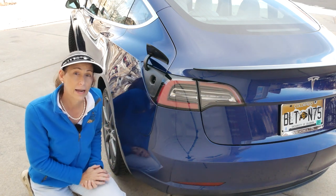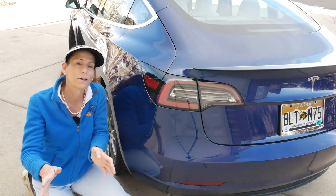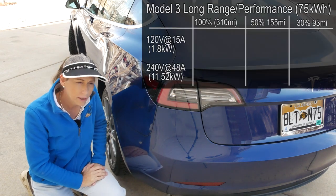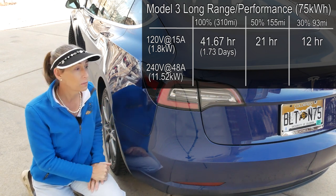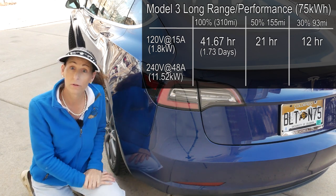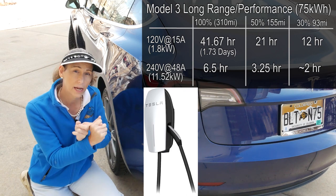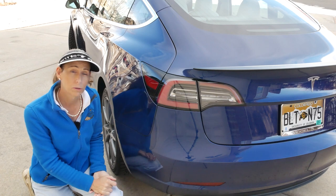To get a really full charge, you're probably going to have to do that at home. It's a paradigm shift — we're so used to filling up out and about, now we fill up at home. You can't fill up your ICE car at home; you don't have gas tanks at home. So what do you need in your house? If you just plug it into a 110 outlet, that's about 20 amps at the most and it'll take probably a couple of days to fill up from empty. But if you get a 220 outlet like for your dryer, you can double the voltage and kick the current up to 50 or 60 amps — that's what a home Tesla charger would be. They're kind of expensive; you'd have an electrician plumb 220 into your garage. And this is the most important bit: you kind of need a garage.